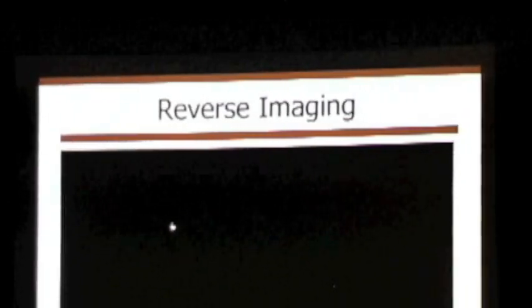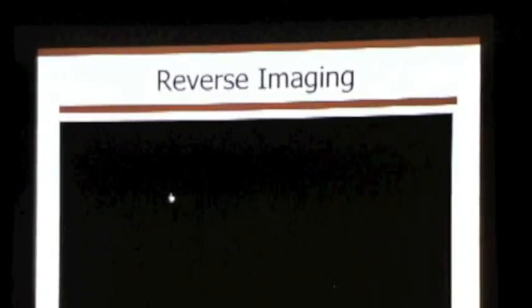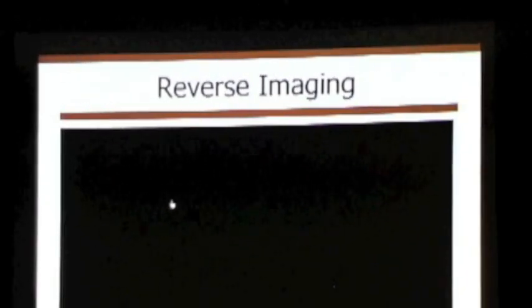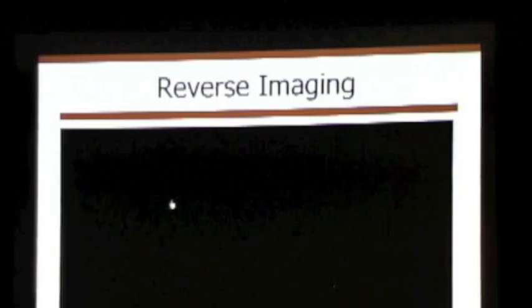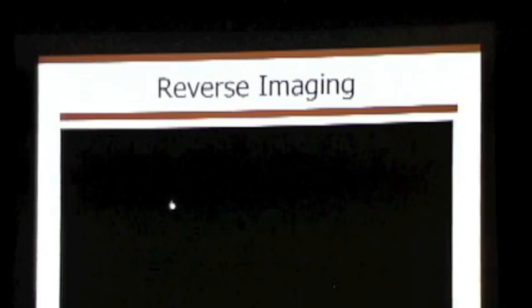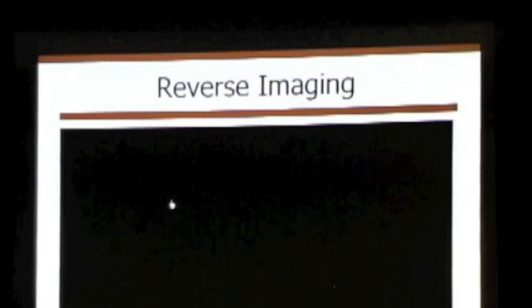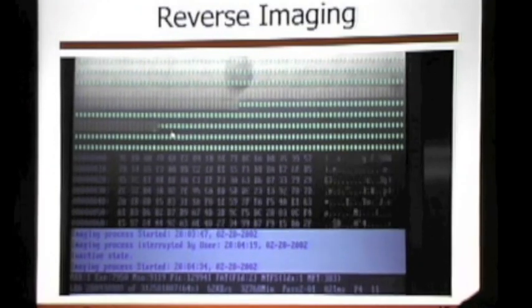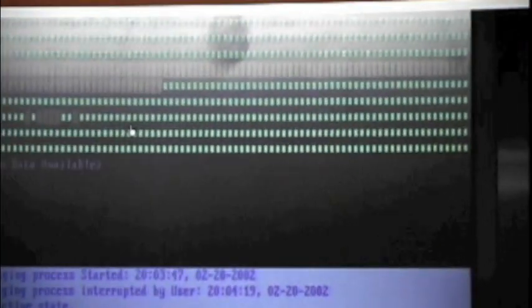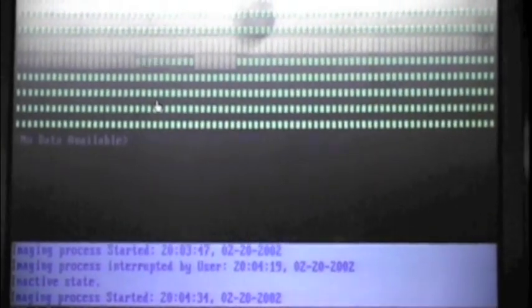This is a piece of hardware that's kind of like BitTorrent — it doesn't care where the sectors come from or what order they're in. It'll go forward and try to read the good sectors as fast as it can. Then in reverse it will try to fill in the holes — the sectors that were bad and couldn't be read the first time — filling in those holes as it goes. And I actually get a display in hex as it's doing this. All the brown ones are sectors that failed going forward, and now going in reverse I'm actually able to fill in those holes and see that in hex, fixing a lot of the things on the disk.